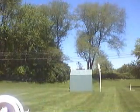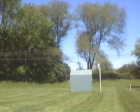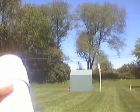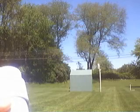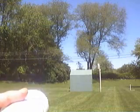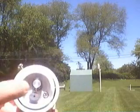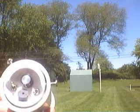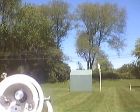Thank you very much. In the background you can see the Ringbox Observatory and the full Astro monitor version sitting up on top of the pole — that will be a subject of another video. This unit can also be controlled by computer. There's a Bluetooth module inside, which will be covered in another video. One more thing: this knob also has an off switch. If you plug power in with it turned off, it will take the last computer settings and ignore the physical switches — whatever the computer last configured. That's all, folks. Thank you very much.